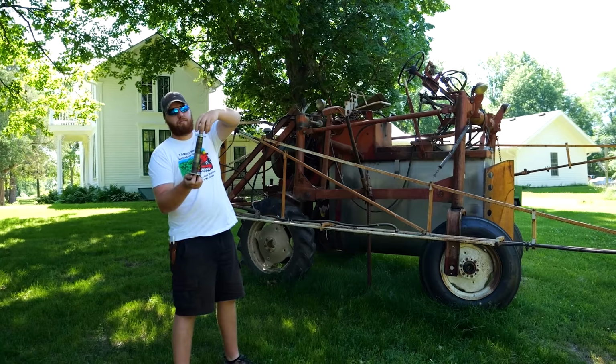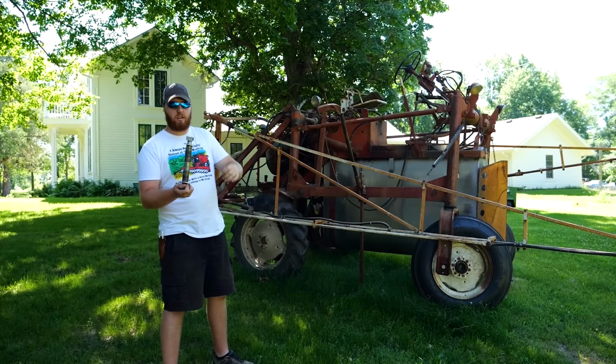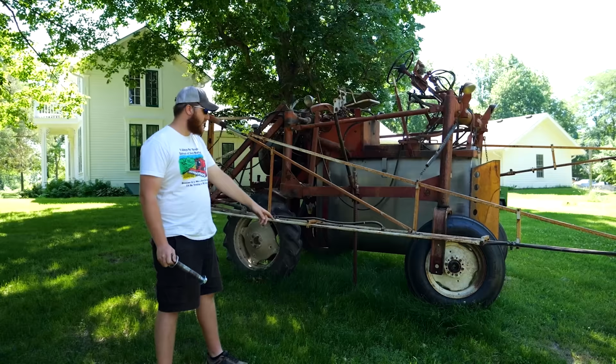I don't even know if we mentioned this, but we had to hammer the spindle out to get that wheel off and it completely obliterated it. So I had to take it down to the shop. They machined it to take a new nut. We're gonna see if that works. So step one today is finally get that tire on the front.